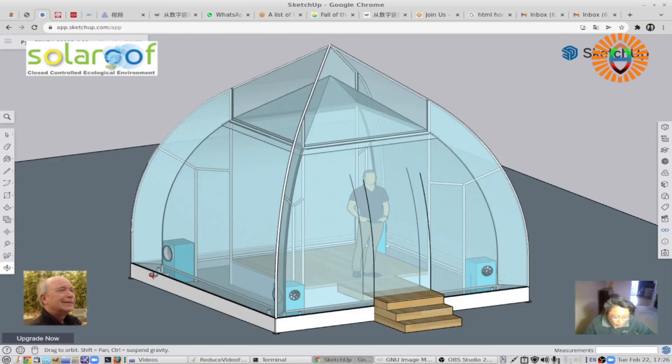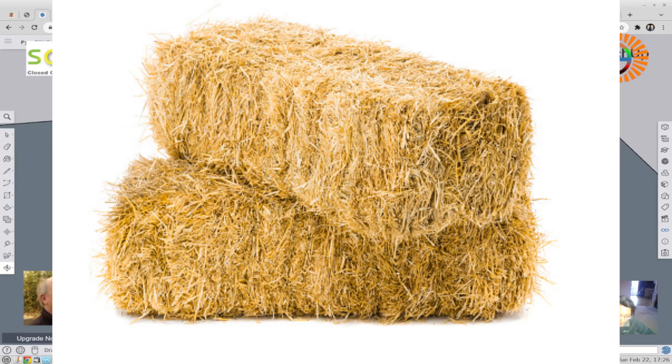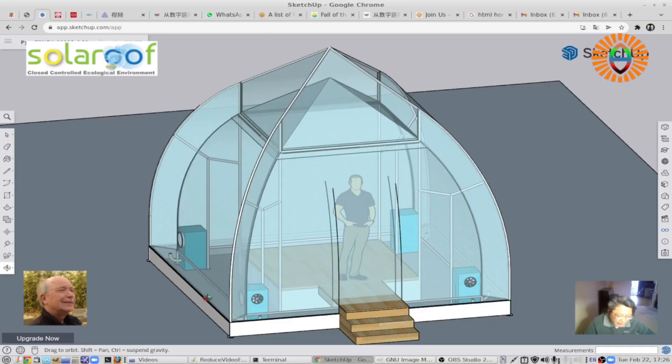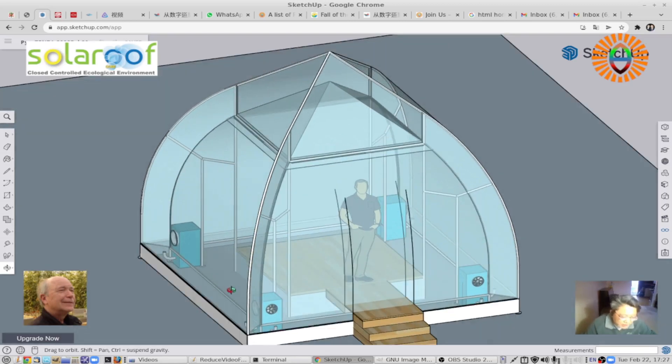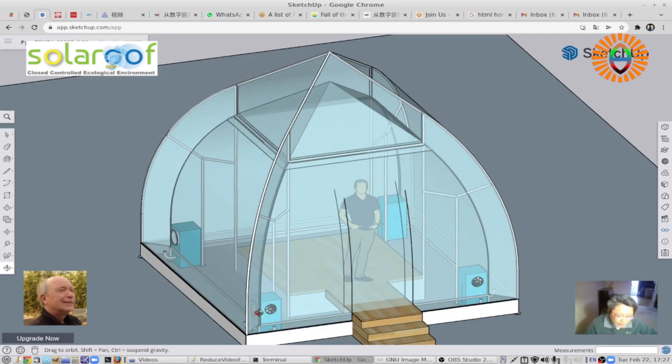This area you can call the knee wall, and we simply use a single layer of fabric or film to cover it. When you build, you can use bales of straw — square straw bales — to line up and insulate the bottom, all the white area, the knee wall. Or you can use other mechanisms. For our commercial product, we're going to provide the proper material with insulation. For DIY, you can use whatever works, as long as this area is insulated — then you won't have the problem of air entering from here or frozen liquid on top of the surface.